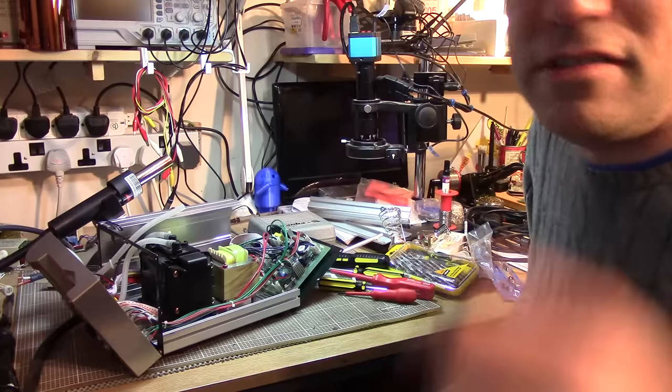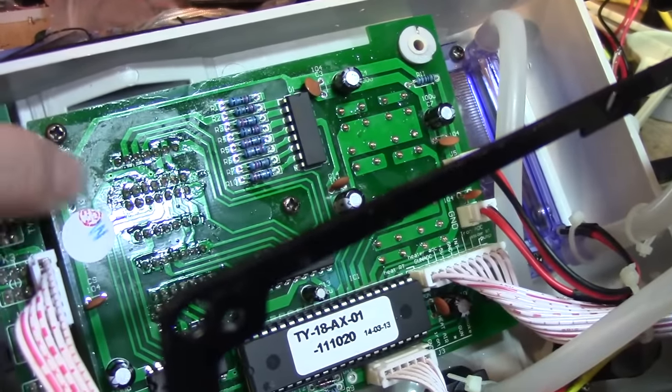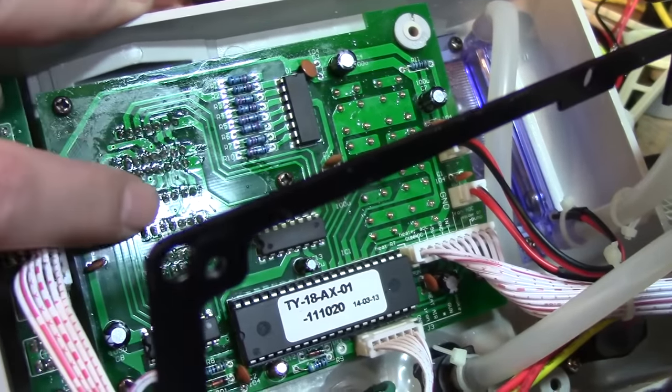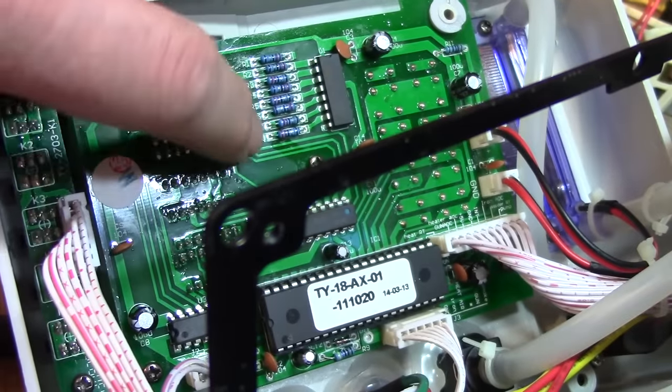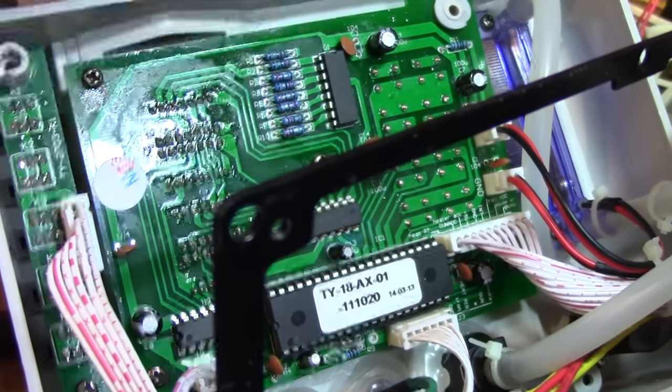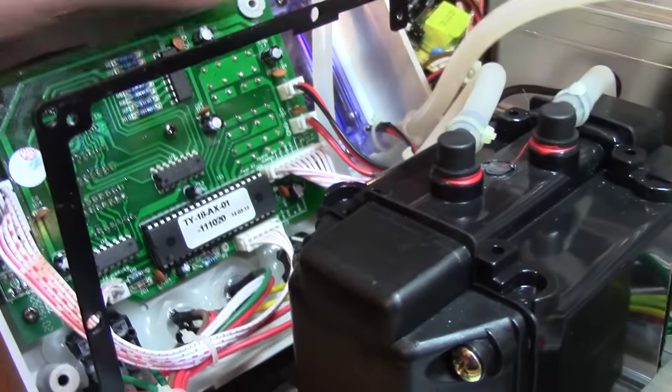While we're in here, let's just have a quick look at these circuit boards. Just looking at this circuit board - we've got a bit of flux residue left from soldering there. These connections on this side have all been hand soldered, and the rest will have been either wave soldered or reflow soldered on the backside. In general they've done a pretty nice job on the soldering. I quite like the board layout with all the low voltage control on one side and the high voltage AC on the other - good board separation. They've done a nice job tying these cables quite neatly.